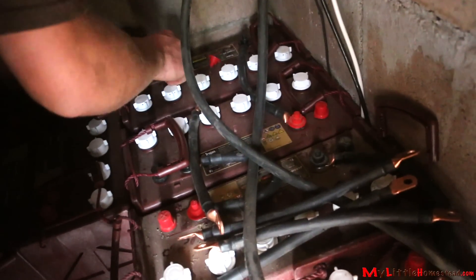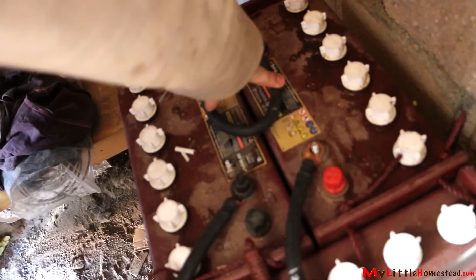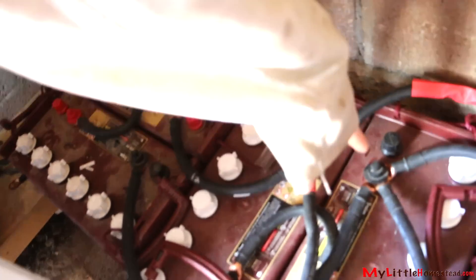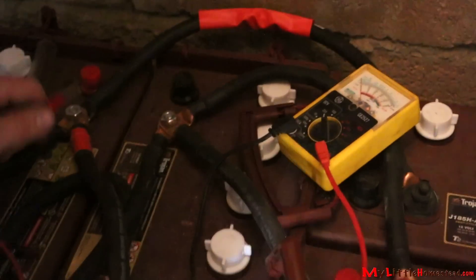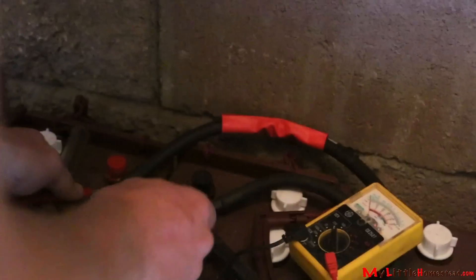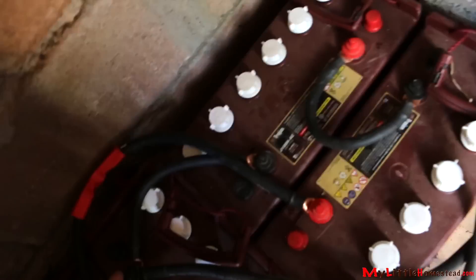I am wiring up batteries. Our system is 24 volt, so we buy 12 volt batteries in sets of two. We have six batteries here. He wired two together with minus to plus using a jumper, then ran the two plus and minus over to a main jumper that connects to all the other batteries — plus to minus on each pair. There are three pairs of 24 volts here, since each battery is 12 volts. I'm going to check the voltage to make sure it is 24 volts coming out, because if you wire them all together incorrectly, you can get like 75 volts out of this thing, and you only need 24. We're right on 24. Then he takes the 24 volts and connects it to the main cables.